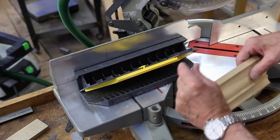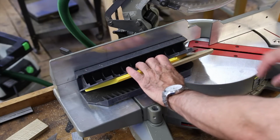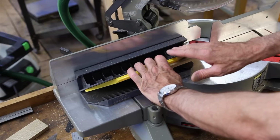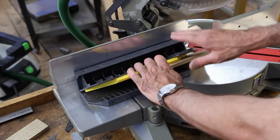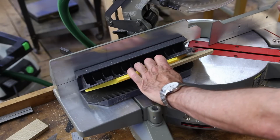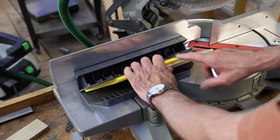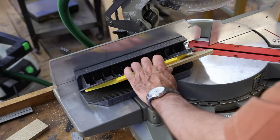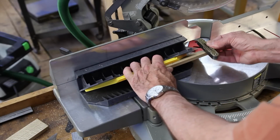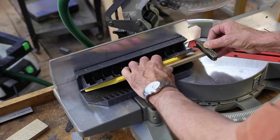So it covers the waterfront, and you simply put that molding in there and make the cuts as normal miter cuts. All left-hand pieces are cut on the left-hand side of the saw. All right-hand pieces are cut on the right-hand side of the saw. A way to check that you have the right shim in there, or lack thereof, is simply to put a level on this part, and as long as the saw is level, this little ledge here should also be level, like so.